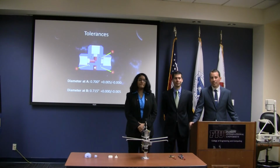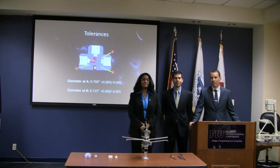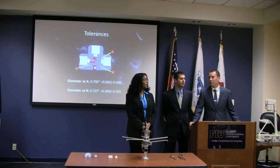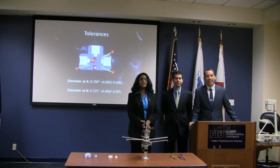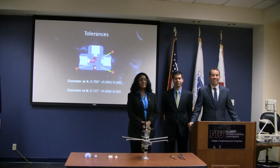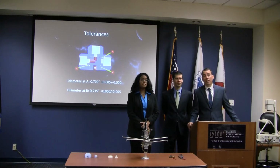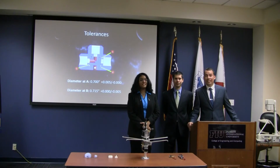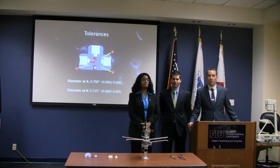Going back to the balloon thing, how do you compare those analytical results with the balloon? We didn't. We used a turbulent solver in COMSOL. Oh, did you use COMSOL? Yes, there were some struggles with COMSOL. It's tough. We also did a stress analysis because the original manifold valve was going to be made out of Delrin, so we wanted to check that it did not fail with all the pressure. After we did the analysis, we had a good safety factor, but when we changed to stainless steel, we assumed it was going to hold that pressure.